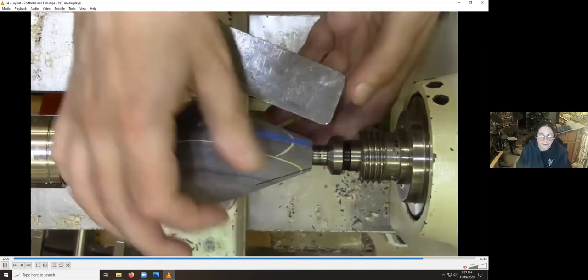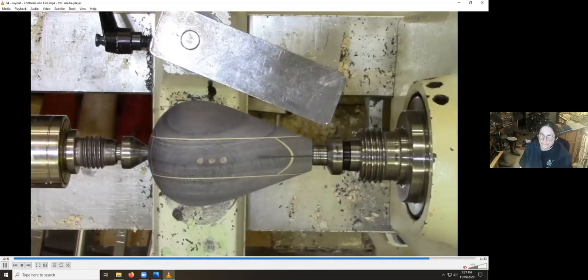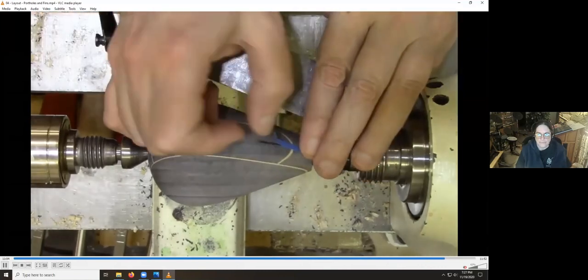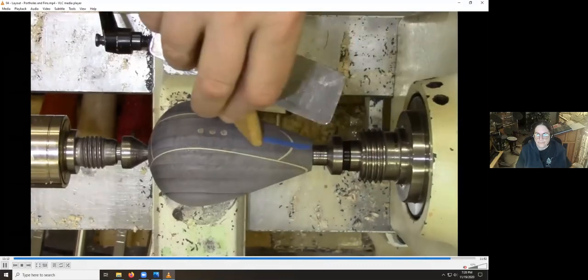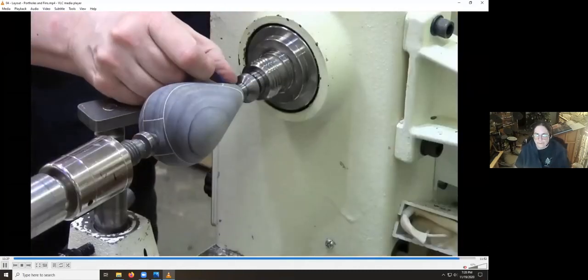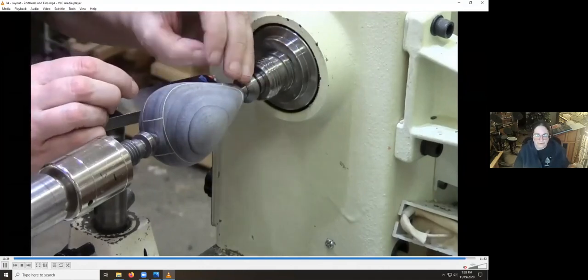I'll go back and clean up that area again before I attach the fins. I'm using the handle of a chip brush — just a really cheap brush I use to brush off shavings on my lathe — to burnish the tape down. The contours of it work really nicely and it doesn't damage the wood unless I'm using really soft wood. It's better than just rubbing over it with my finger — I get a better seal.